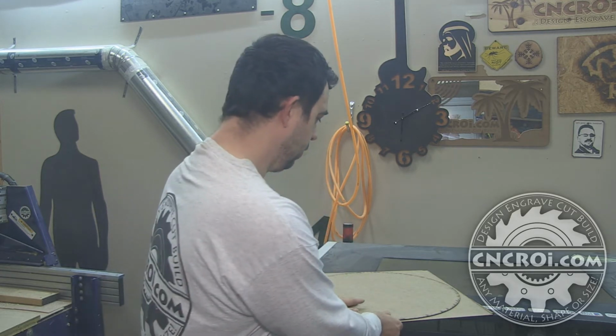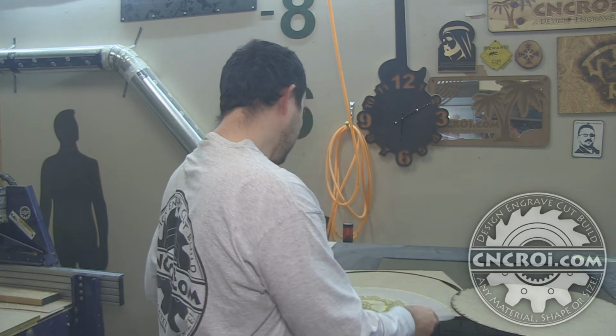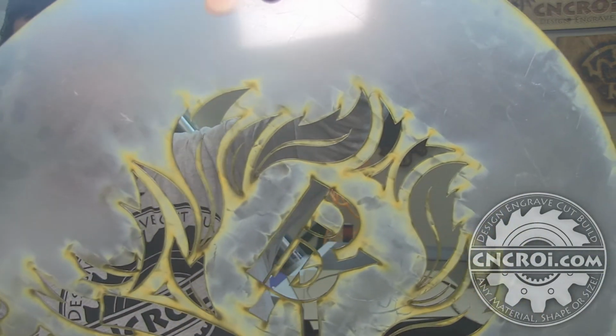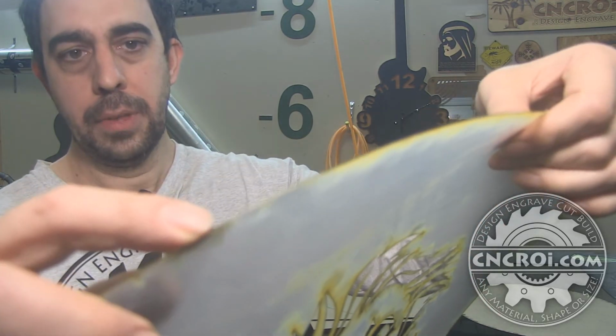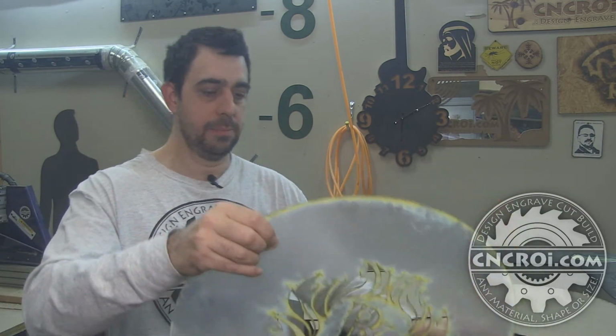And the other thing you'll see here on the stencil, by the way, is that the aesthetics of the stencil, not the design, the actual aesthetics of the laser burning and laser cutting look pretty awful. And the reason for that is this is on purpose, because what I did is I left a little layer of masking on both sides. Now if I want to have a really nice picture, I take the masking off, and all of this burning stuff that you see here is gone.